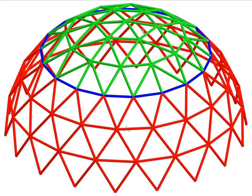And by the way, those of us who've done domes over the years have figured out that if you don't have four-place accuracy, you're in trouble. So one of the things that made domes really difficult early on is that we were using mainly slide rules. Slide rules are only three-place accuracy. We could never do a smooth, proper dome working off numbers that we generated from a slide rule. So that's where the Marchant mechanical calculators became crucial to giving us adequate accuracy.